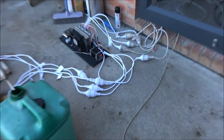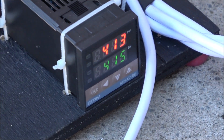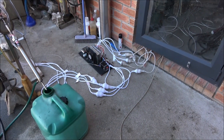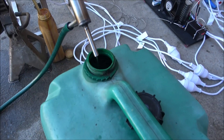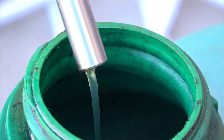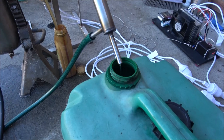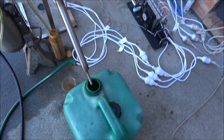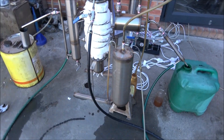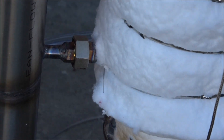I keep the temperature at about 415°C. I personally prefer to process oils at 410°C — it's not that fast but it gives a really clear, good result. Here you can see the actual distillation output. You can increase it by increasing the temperature and processing different types of oil. The unit itself is 6 kilowatt.